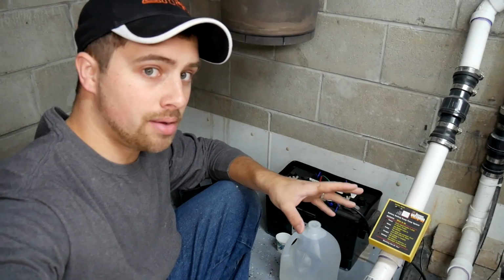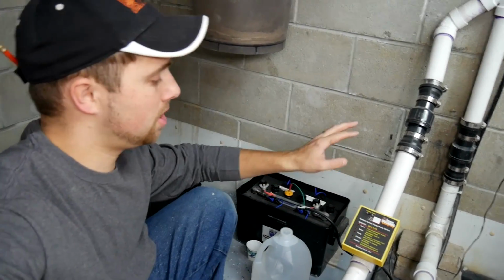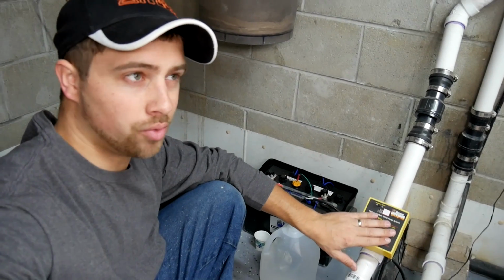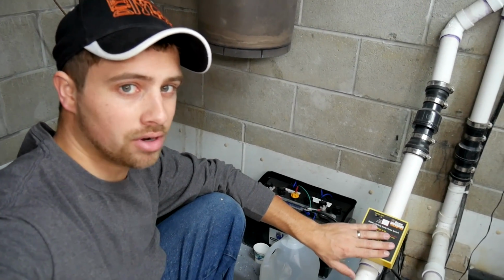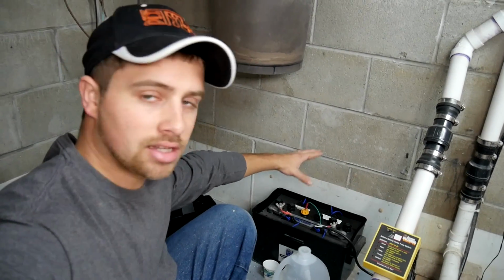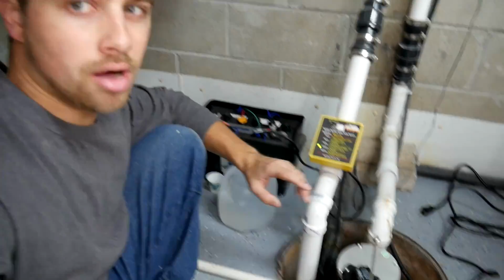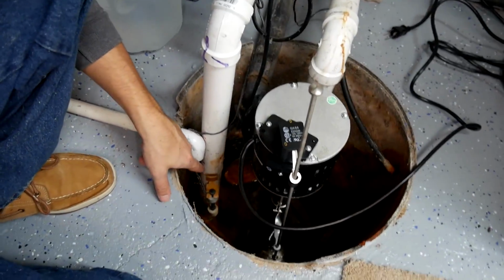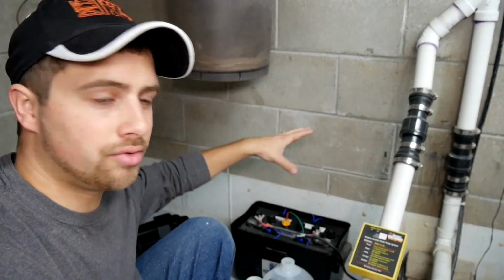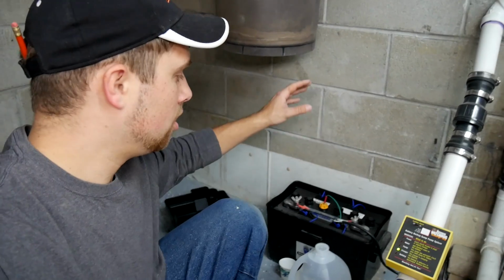All set. So one of the reasons I'm pretty comfortable with a sump pump in my house is that I got a backup system. This is not sponsored, but I've used this one for 5 years now, and my dad's had one for many years in his house. It's a WatchDog backup system. It is connected to a battery, so if your power goes out in the house, you have a totally separate pump. It's a tiny little pump in the bottom there. Probably can't see it. That will run for like 12 to 14 hours off of this battery if you keep it charged up. You do need to service it.